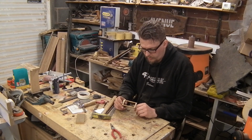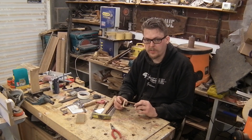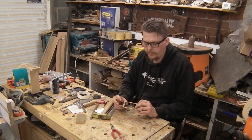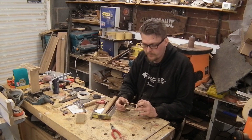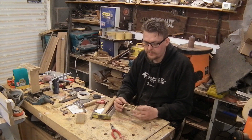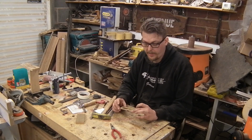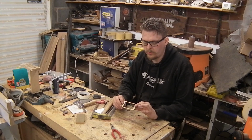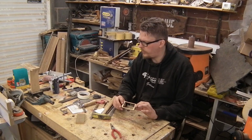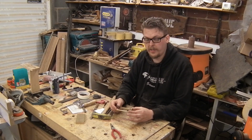Basically, all that's left to do to get this to become a usable pickup ring is round off the corners, smooth off the top edge, polish it up a bit, and drill the holes for mounting. Obviously, because it's going on a curved top, I need to actually shape the underneath of this to sit properly on there. What I might do is use a 12-inch radius block and actually radius the whole of this ring,